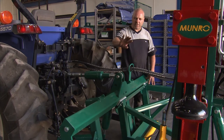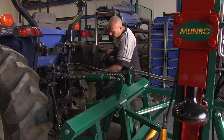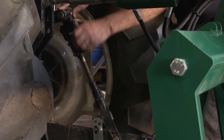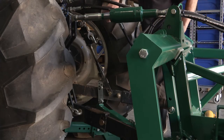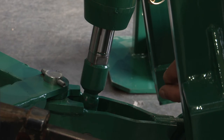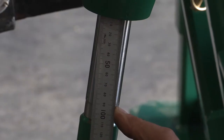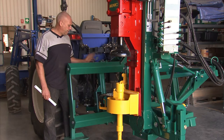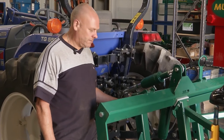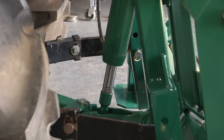Because we're moving the machine out to the left-hand side of the tractor, that can cause a bit of instability with all the weight hanging out that side. To help overcome that, we can adjust this arm to put a bit more downward pressure on this lower link arm — wind it in the downward direction so it offsets the load a bit more to this side. The next check is the downforce cylinder. We need to make sure that this rod is not going to run out of travel in either direction when the machine's lifted up on the lower link arms. It's a six-inch stroke cylinder, so we don't want the rod to come out more than about five and a half inches. We measured the ram and it came out at 90mm — full travel is 150mm — so there's no fear of the cylinder topping out. With the machine down on the ground, there's only 45mm sticking out, so there's no chance of the ram bottoming out either.